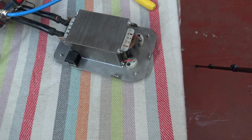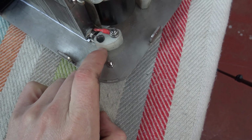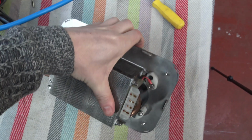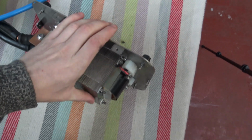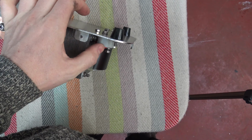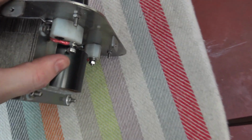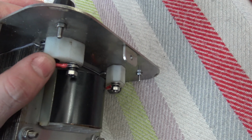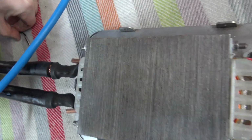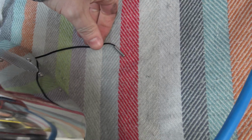And then nylon blocks, one side is full of epoxy. They're actually counterbored for the bolt. I'll try not to knock the cover off the table. I'm going to set her up on its side here. So here you have the bolt that's going through the nylon block to hold it to the body. Them two bolts do not touch each other. The two of them are offset and counterbored to act as an insulator for the primary winding. This is the temperature probe, which I slid out of the core before I took the cover off.